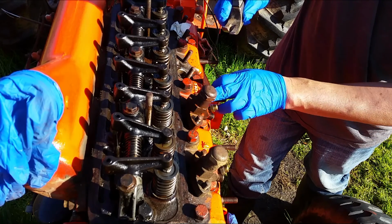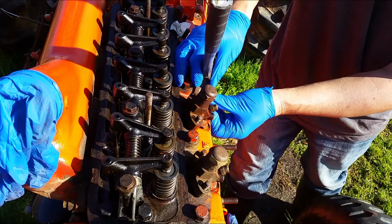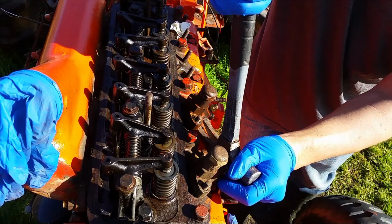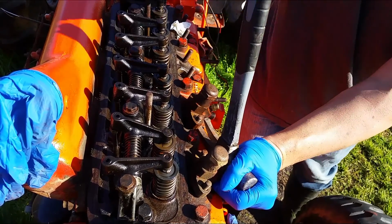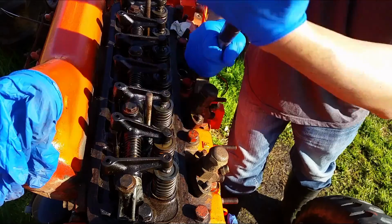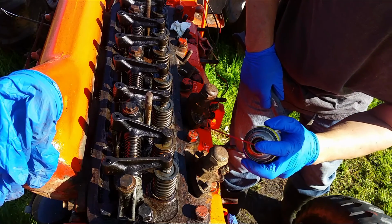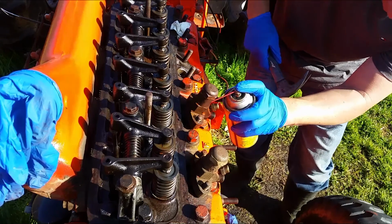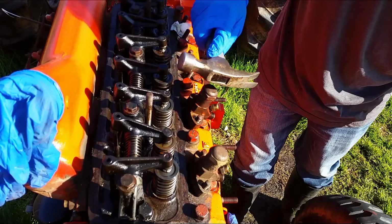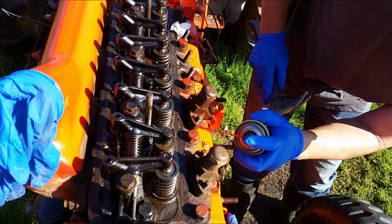And I don't mind scratching up the paint over here because I'm painting it. If you worry about scratching the paint, put a pad underneath here. Stuck in there really good. There you go, it popped up. You're going to work evenly on both sides. And sometimes it doesn't hurt to tap back and forth a little bit. Now's a good time to work that penetrating fluid underneath there. And just carefully tap it back down. And this way the fluid can get in there and loosen things up.